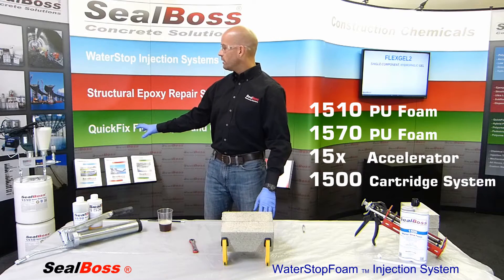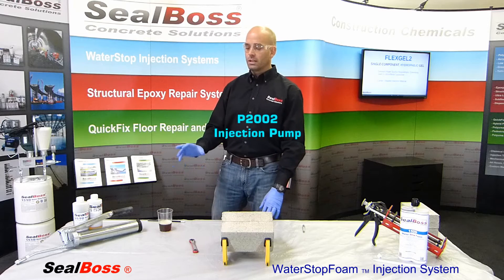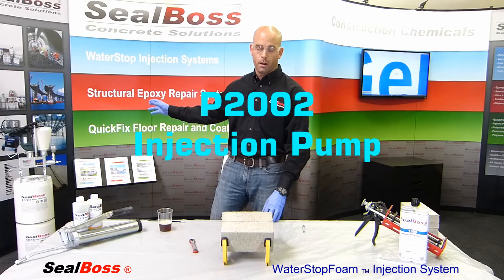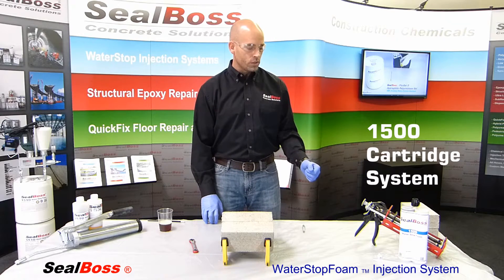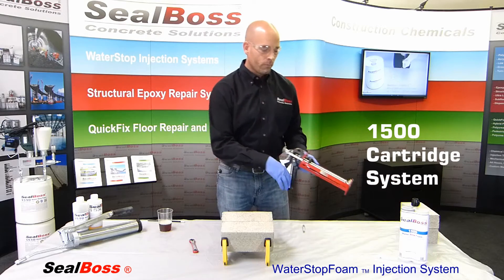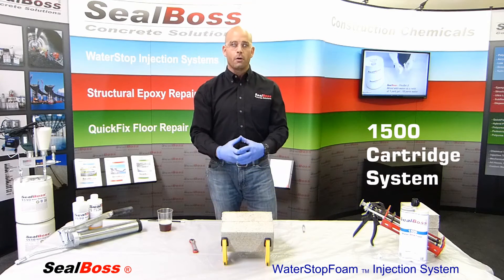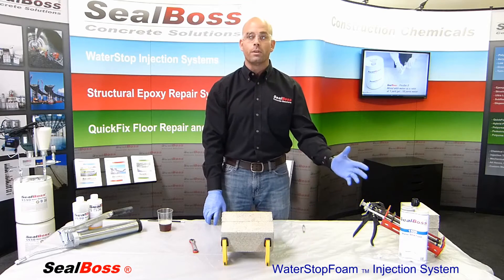In this type of application you will be using the P2002 by Seal Boss — it's a high pressure polyurethane pump. For homeowners and light industrial, that's what we have on the table here, and we do recommend the use of these products unless the contractor or homeowner would like an industrial grade pump. To my left I have the cartridge form of the polyurethane, the 1500 series by Seal Boss Corporation. It's deployed by use of a one-to-one handheld tool like a dual barrel caulking gun and a static mixer that goes on top of the cartridge. These two can be used in light commercial applications and are very space friendly — outfitting teams in pickup trucks with multiple cases of the product, a few guns and static mixers, would not take up a lot of room.